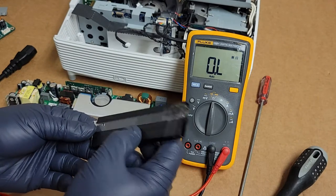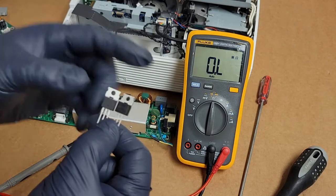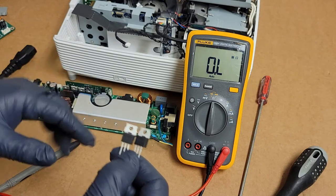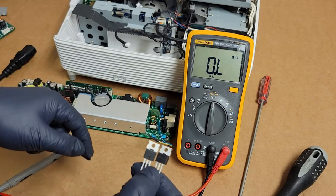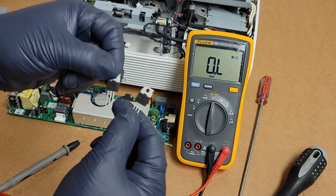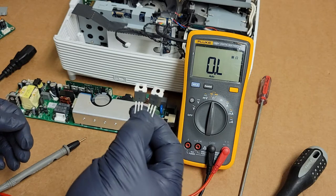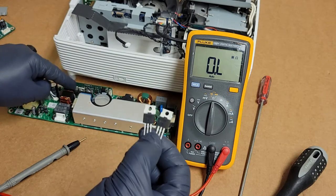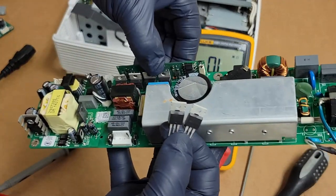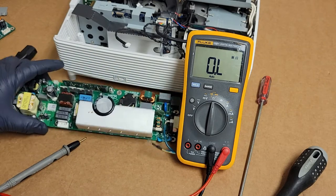I don't have any 19N20s, but I do have some 57N20s. A 19N20 is 19 amp average power handling at 200 volts — the first number is the average continuous current. These will do up to 57 amps; the datasheet says 33 amps continuous. Either way they run at 200 volts and will handle more power than those. So I'm going to switch out the pair — you always want to do it in complements so they're as even as possible. These were from the same batch and matched when I bought them.